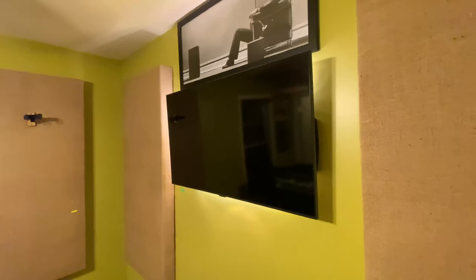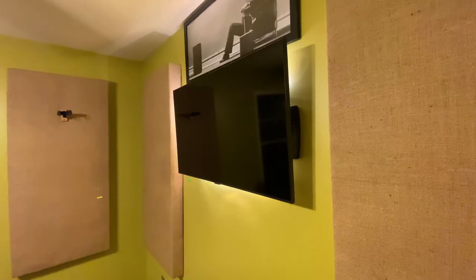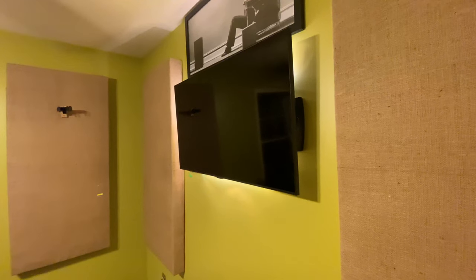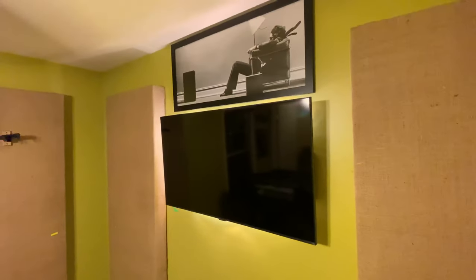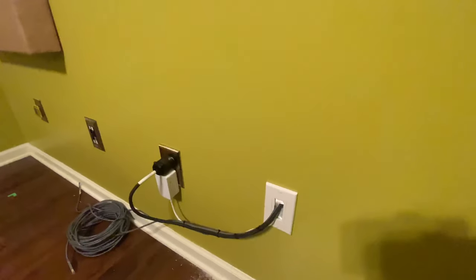And then the Hue lights: the power cable that connects the power supply and the lights themselves on this new model isn't interchangeable. I didn't realize that because both the ends looked almost the same. So if you're installing Hue lights, just something to be aware of. I had to refish that up through the wall, which was not the funnest thing in the history of the world. So here's the exit.